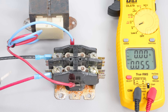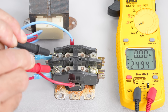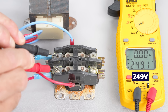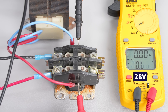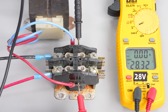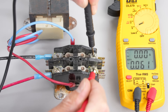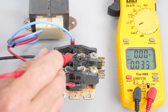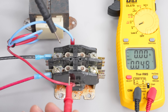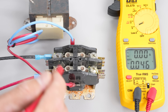Here we have our 240-volt power wires, and you can measure 249 volts with a multimeter. Over here on the coil we have 28 volts, but over here we do not have any power — so the issue is that this contactor is not sucking down. If you have power in and don't have power on the output side, you may have a cover over it and not know.